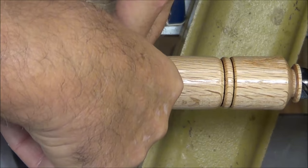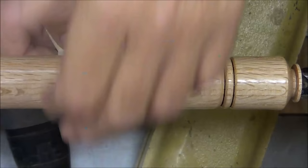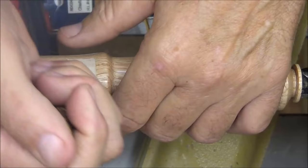I need to drill a hole for my leather string, so I'm putting a couple pieces of tape on just to keep me from having tear-out when the drill bit comes through the wood. Then I use a center punch to help me get a starting point for my brad point bit.